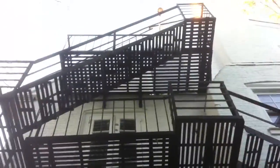If there is any changing of any bolts on this fire escape, and up there towards the top it's square heads, down here it's hex heads, it's an indication that somebody did not do their job as far as making sure the rust was 100% removed. Once the rust is removed, we highly recommend that you seal these joints up so that the rust doesn't grow again. And if the rust does grow again, these new bolts are now no good, because now nobody was going to sign off on this, on these new bolts.